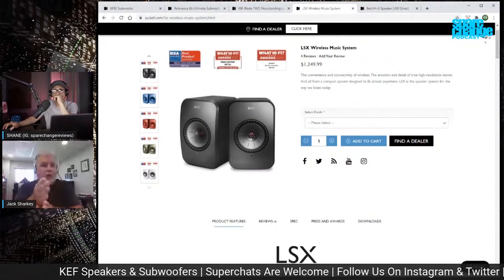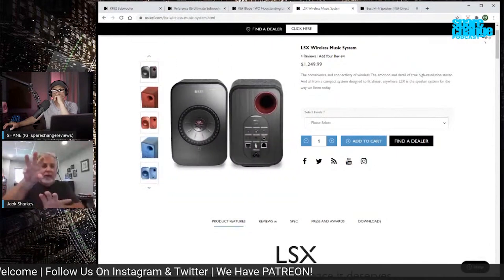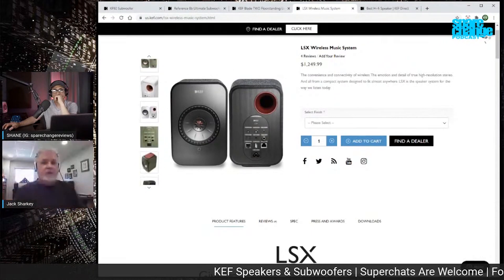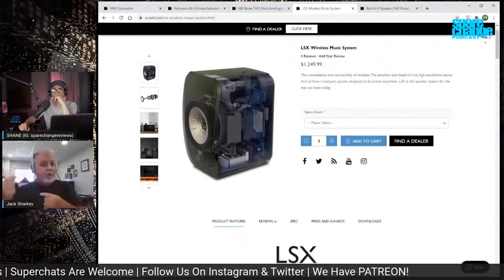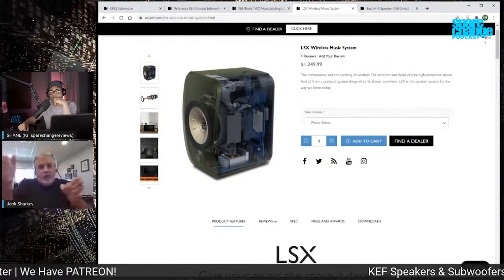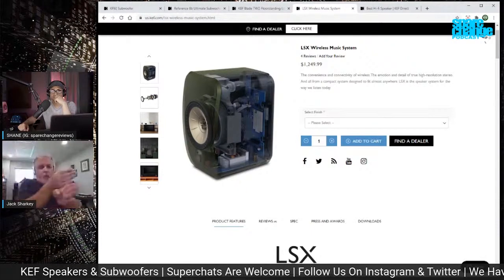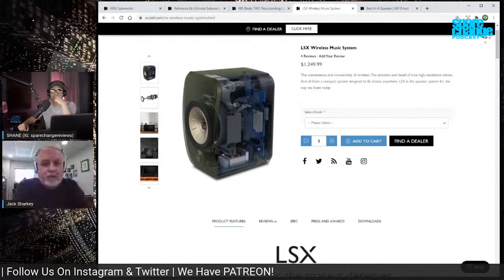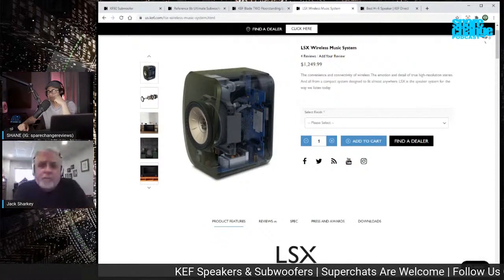What we wanted to escape, the design flaw we tried to fix, is that in most speakers if you have the tweeter here and the mid-range here, you have the same sound leaving from two places at the same time. It's like the train from Chicago and the train from St. Louis — they arrive in New York at different times. That's what happens with sound, and your brain can't process it as cleanly as it should. By precisely placing the tweeter in the center of the mid-range, we've aligned the time so that no matter where you're sitting, the sound arrives at your ears at the same time.